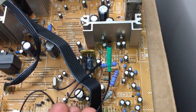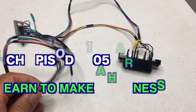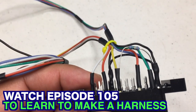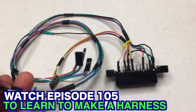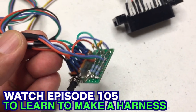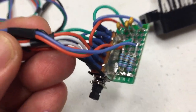Now that we confirmed everything would be working, we can get started making a dab nabbit harness. Here's the harness that's gonna be installed in the TV. I put the 75 ohm resistor for sync right at the SCART connector. I really should have put all the terminating 75 ohm resistors at the connector instead of on this perf board. Would have made life more easy peasy.